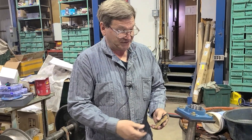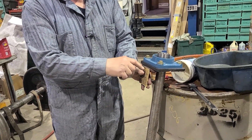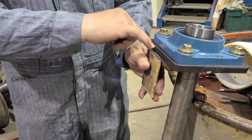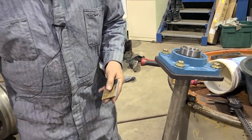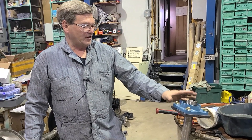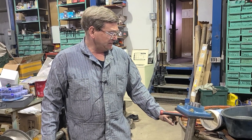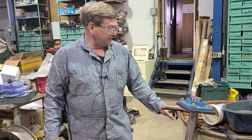Sometimes you've got all kinds of stuff set up and you don't have another piece of steel — so you're going to weld up beads on here and purposely leave a little slag in between these two. Just build up some welds, leave the slag, do not attach to this, and then let everything cool off. Then bridge your weld over there after you've chipped the slag out. Some of the boring rigs I've worked with, you didn't have a way to adjust them afterwards — you just had a bearing that bolted down and there's always a little slop in the holes.